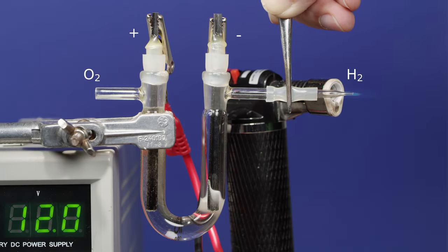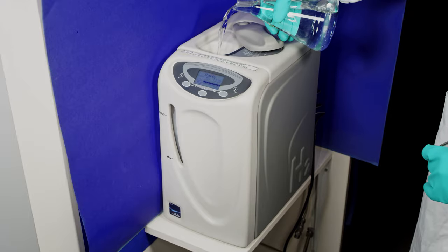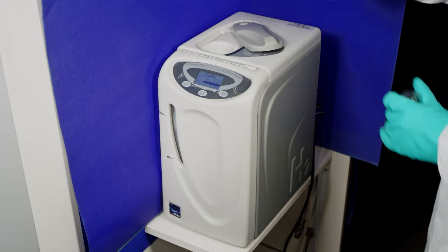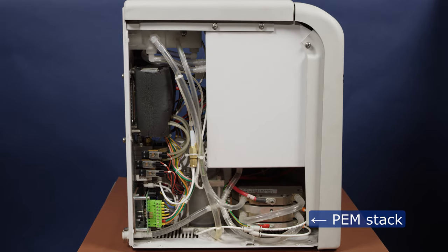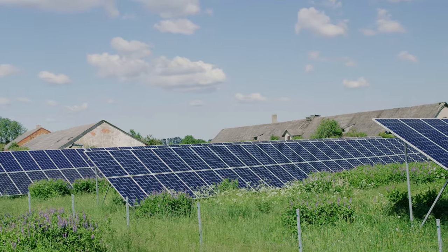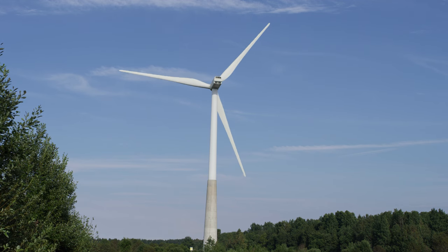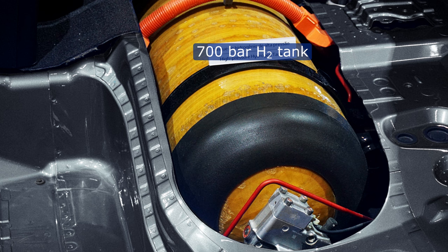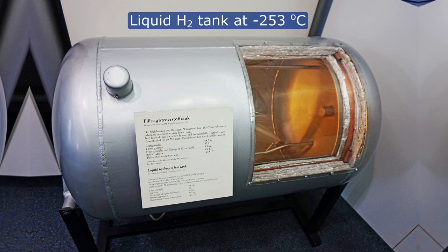The simplest method to make homemade hydrogen is with the electrolysis of aqueous salt solutions. PEM electrolyzers consume only pure water and are more efficient, approximately 60 to 70%. Hydrogen can be produced from renewable energy sources when solar or wind energy production is higher than demand. Hydrogen can be stored using high-pressure vessels or chemical hydrides, which chemically absorb hydrogen. The highest energy density is achieved in the case of liquid hydrogen.